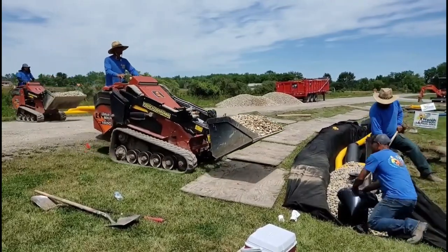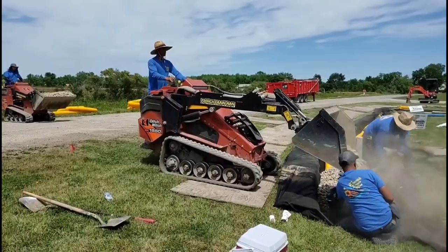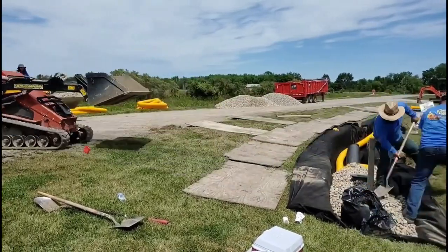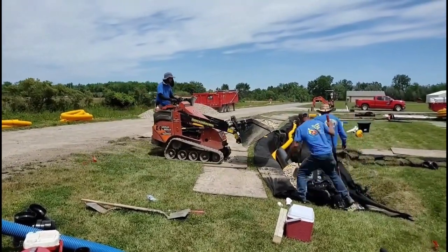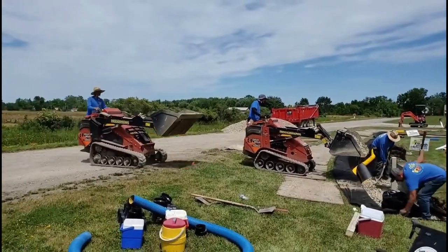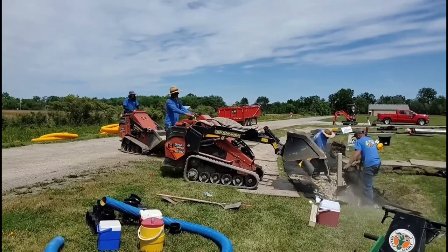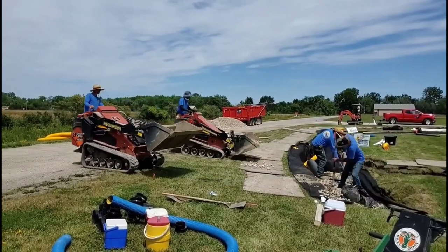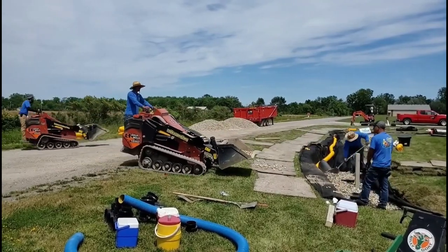If we're having a really big rain event and the pump can't keep up and falls a little behind, the chamber will act as on-site storage — that is ever so important. Then when the rain lets up and subsides, it continues pumping until it pumps that chamber down. It's a dynamite setup — it's all we use outdoors, the chambered sump pump systems.